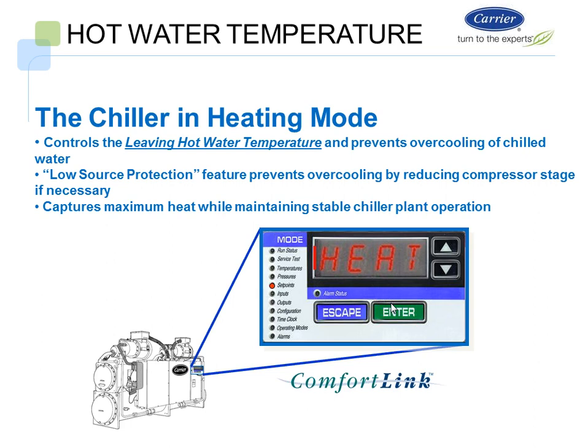As I reach a certain suction temperature, it'll unload stages, but it'll also be trying to control to a hot water set point. If at a certain time I cannot meet that hot water set point, I will basically unload a couple of stages on the machine and keep the machine operating and running in a stable environment, not always cycling on and off.